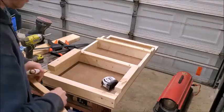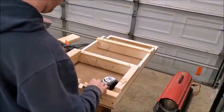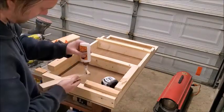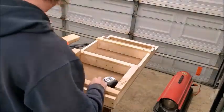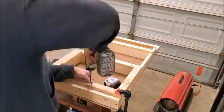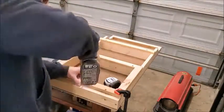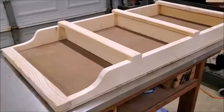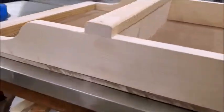It's going to be very sturdy, a little bit of wood filler. You'll never know that the screws were there holding them in place. Unfortunately, this lower section did break at that wood knot, but it's not the end of the world. Add a little extra wood glue, some additional screws, and it's no big deal up until, whoops, that point where I broke it, but no big deal, some wood filler magic, and you never know it broke.